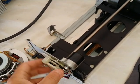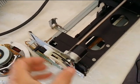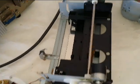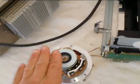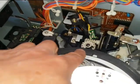When I'm fixing a machine and it needs a new loading carriage, if I have a matching working one, I'll swap it out. So in this case, I just happen to swap it out. This one I will fix later, and this will be another working loading carriage. But again, I swapped out the video head scanner. I swapped out the loading carriage. I swapped out the belts and cleaned up the loading drive.